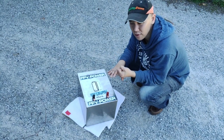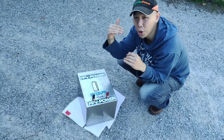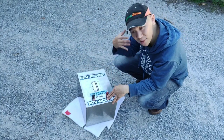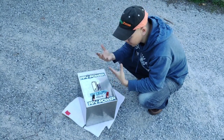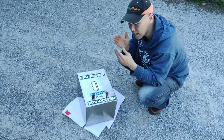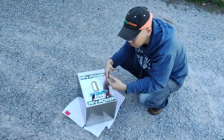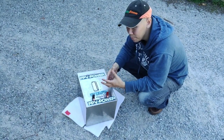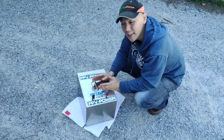The temperature is 25 degrees, because the power of the solar panel is rated at 25 degrees. So every degree you go up from 25, 26, 27, 28, a 30 degree day, a 35 degree day, you lose efficiency. You can look that up and calculate it yourself. And then there's the angle of the sun: 90 degrees from the sun hitting the solar panel. Because his solar panels are fixed on his motorhome roof, it's fixed. And when you park your car, you generally want to park in the shade.